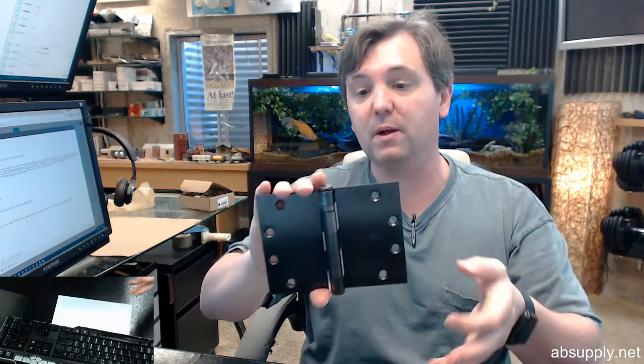Or a more appropriate scenario would be the possibility that you are working on a door that has 5 inch hinges, and it would be appropriate to have 5 by 4.5. Or as common, or even more common, are aluminum storefront doors, where they have 4.5 by 4s. 4.5 tall by 4 wide, not 4 tall, 4.5 wide. So anyway, the height is the first dimension. Where are you going to use this? Well, anywhere where you need to pick up some additional clearance.